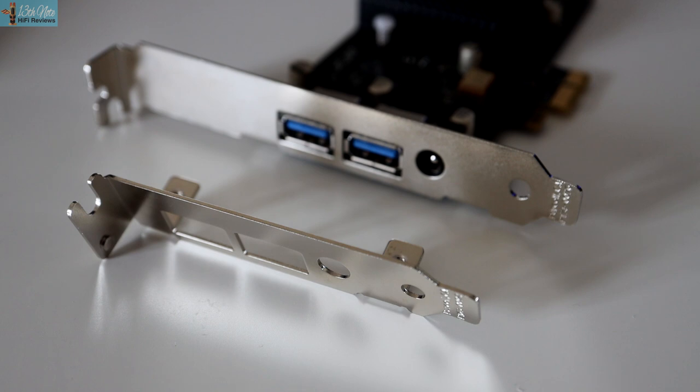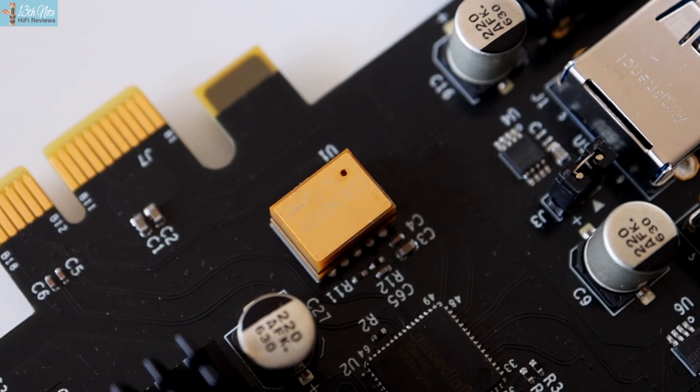There's a full-height bracket and also a low-profile bracket, a shorter type, as part of this package. As part of my research for this review, I was trying to find out more information about one component this sound card uses: its Emerald OCXO — oven-controlled crystal oscillator — which is the part that times and clocks the data. The price was around £100 online, and I couldn't find any other streamers or streaming cards that use a similar type of clock for a component around this price. So you're going to get better jitter handling capability, better timing, and that may translate into hearing better sound quality.